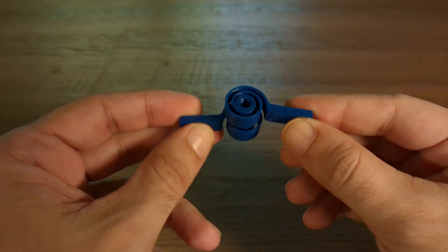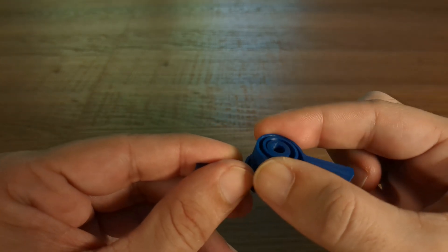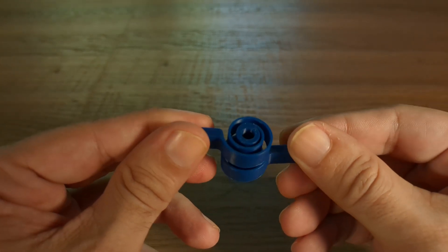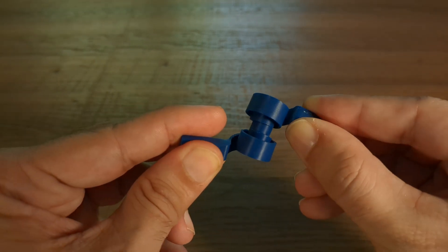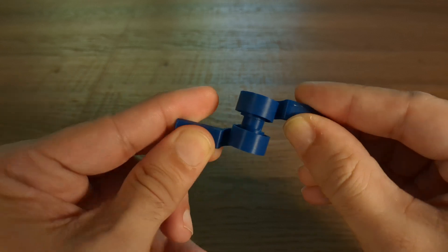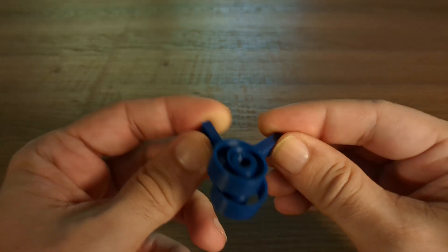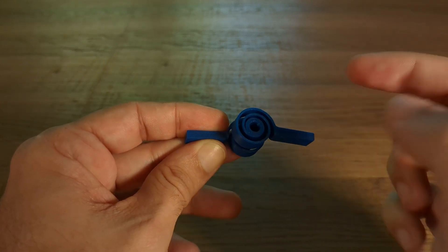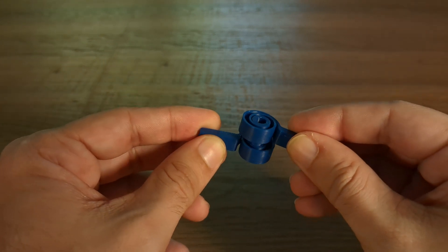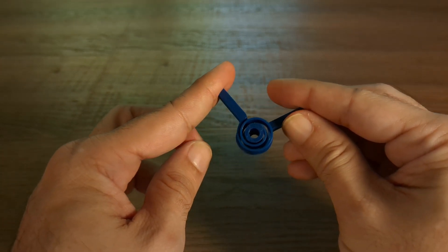Let's look at a single Fingy knuckle. It has two springs: one twists clockwise and the other counter-clockwise, and both are connected in the middle. This bending mechanism, called a flexure, allows me to use PLA — a common but usually less durable 3D printing plastic. The springs distribute the bending stress across the whole length of the spring, making it much more resilient. This means the knuckle can be bent thousands of times without breaking.